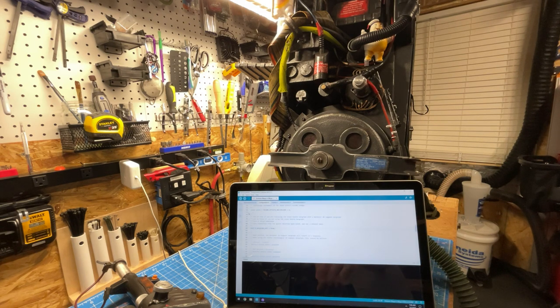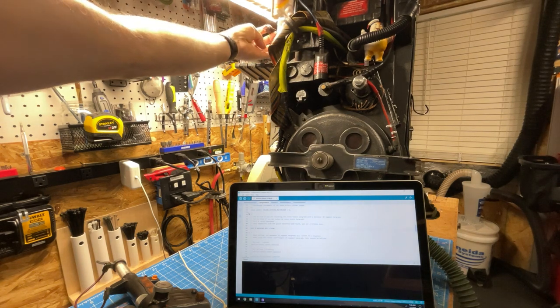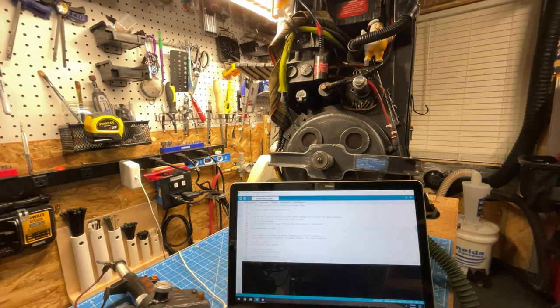One other thing that we'll need is a USB cable, at the very least, for the pack. I believe in the kits, you will be getting essentially a USB serial cable. Basically, it's a USB to UART connector. It has a built-in chip that will do the serial conversion.